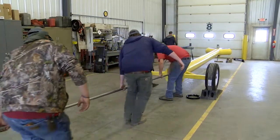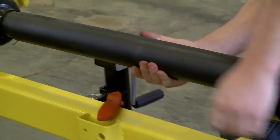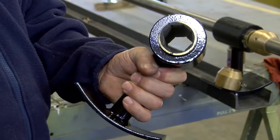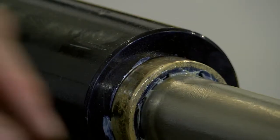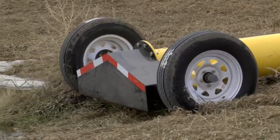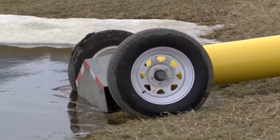Rosendahl used technology from deep-well turbines, submersibles, and centrifugal pumps. Then he improved on it with features like a stainless steel power shaft and neoprene-lined turbine bearings for durability. In front of each bearing, so that no debris, grit, and grime gets in, they put a sand collar on. A bottom feeder also prevents debris from getting in, and you don't need to dig a sump hole.